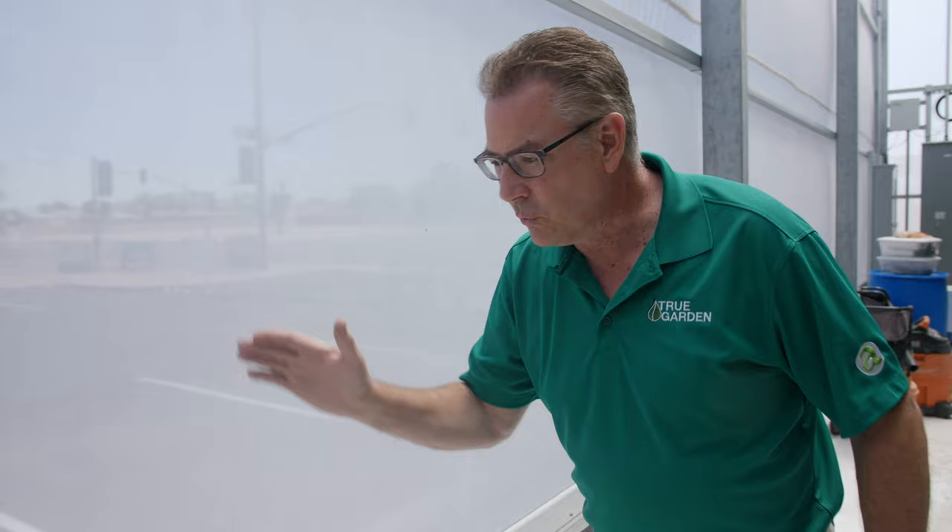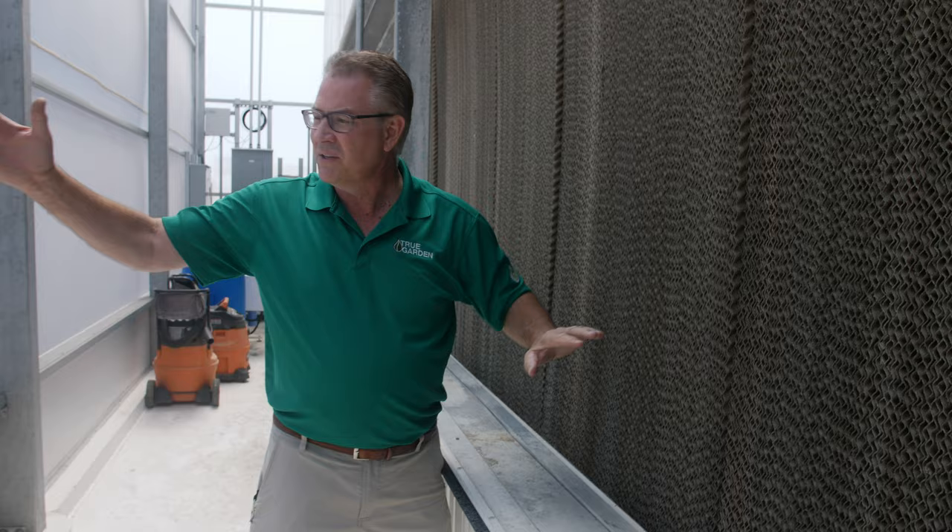On days that are 120 degrees here in Arizona, we can cool this down with an incredible wet wall. This wet wall is like a big swamp cooler. It's 44 feet long, 6 feet tall, 6 inches deep. We're pulling this hot 120-degree air through it and it cools it — we can cool it down by 25 degrees. It's incredible technology. We run water through it, pull air through it, and it's just that British Thermal Exchange where you get that drop in temperature. A great way to cool the air in your greenhouse.